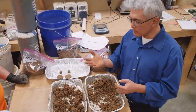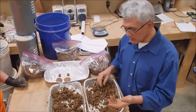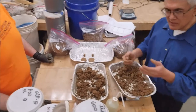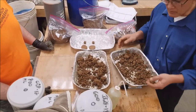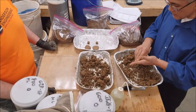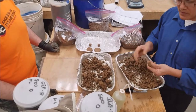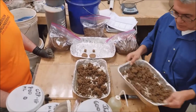Moist means it leaves water on your hand. Damp is somewhere in between — you can feel it but it's not wet. We got it just below the sticky limit; if it feels sticky you probably have too much water. The test we're going to do is called the roll test or thread test, which is essentially the plastic limit test for the Atterberg limits.